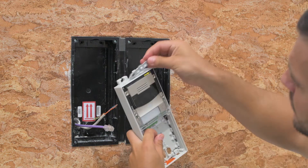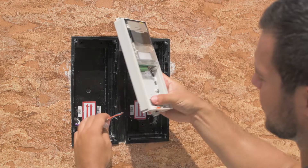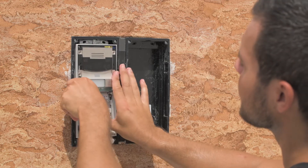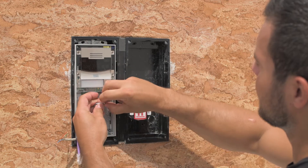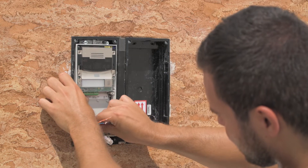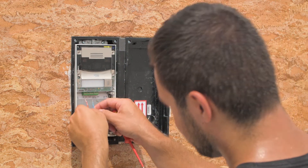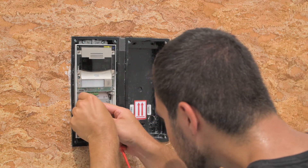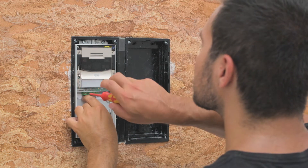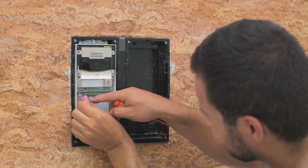Mount both fixtures and pull the cables inside the Verso. Now tighten these three mounting screws, trying to keep the Verso as centred as possible in its box. Connect the door strike cable to either the output, which is active, or the relay, which is passive. Then plug in the ethernet cable and tidy them both up.